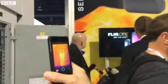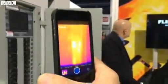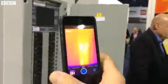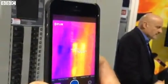You are able to get a very clear idea of where moisture issues are, where there's insulation issues, drafts, any kind of the ability to see studs in walls or a hot pipe behind a wall. If you look over here, this is an electric circuit panel. And very quickly with this, I'm able to see that the top three circuits are the ones that are hot. And I can read what those circuits are. Now, those are not in overload condition, but I quickly could, if I wanted to, put in temperature measurement. I could now measure that temperature of each one of those circuits.